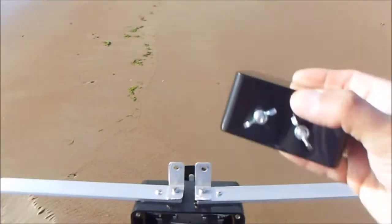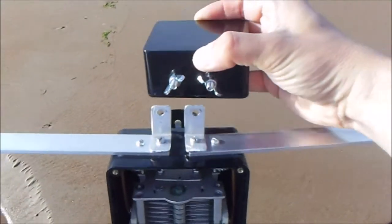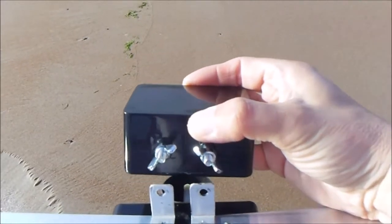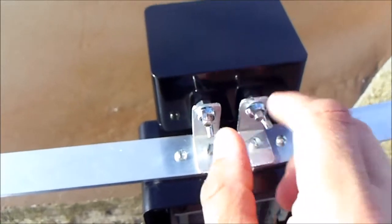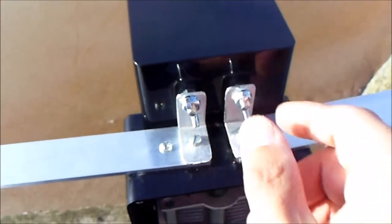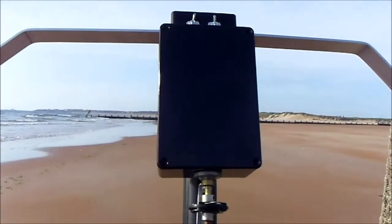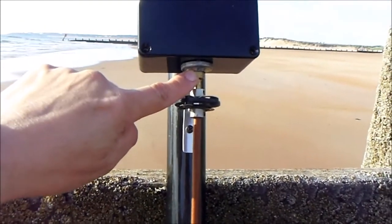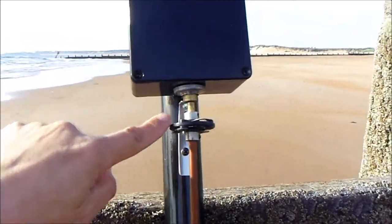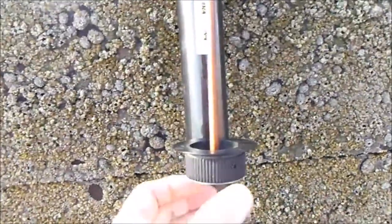In order to cover the 20 and 40 metre bands, I've had to use external plug-in capacitors — little modules secured in place with wing nuts. Because of the loop's high Q and very narrow bandwidth, the tuning can be very sharp. So I've fitted an external reduction drive with an insulated shaft and a large tuning knob to aid with the tuning.